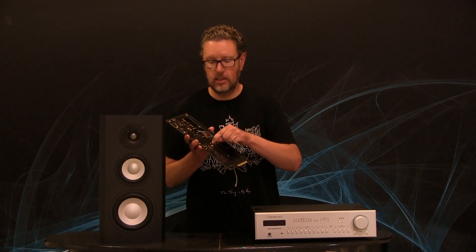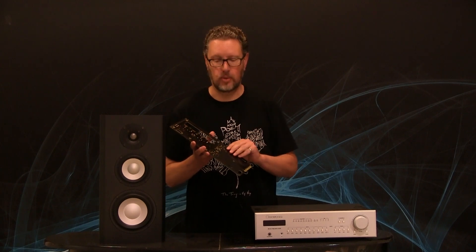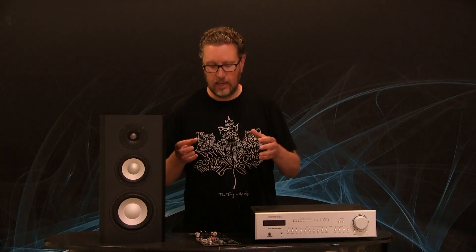For surface mount parts, we need to do two things to install the part: we have to hold it in place, and we have to solder it to the board — flow a liquid metal alloy to make the electrical connection between the component and the exposed pads on the circuit board. To do that, we use something called solder paste, which is an amalgam of different metallic elements and flux that helps the solder flow and cover the pad and component contacts, and is also tacky so it will hold the part in place.